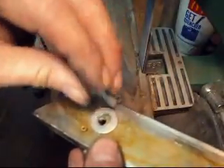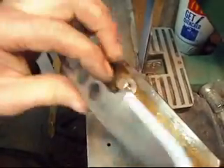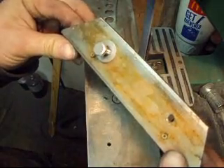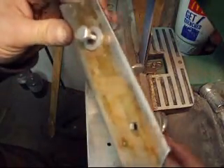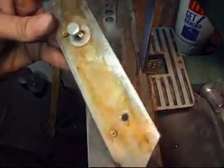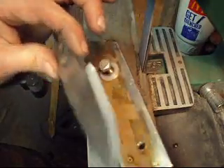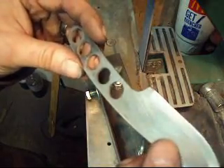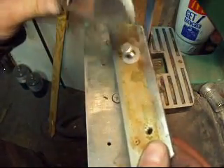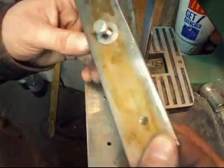Let's talk a little bit about grinding jigs. The biggest benefit with this jig is that the blade bolts onto the jig, and when it needs to be dunked in the water, you take the whole jig and all and dunk it in the water, pull it back out and you're good to go. It's made out of metal — I used to have one out of wood and every time I'd bring the blade back to the wood it would get soft and just wasn't good. The main benefit is the consistency of this grinding jig, and that was a huge design motivation.